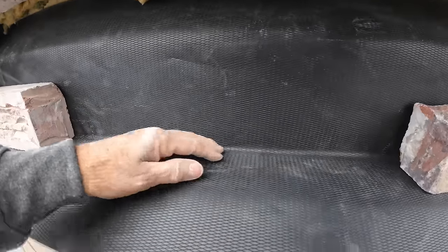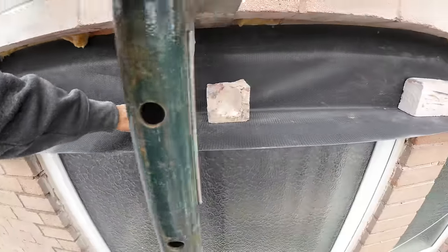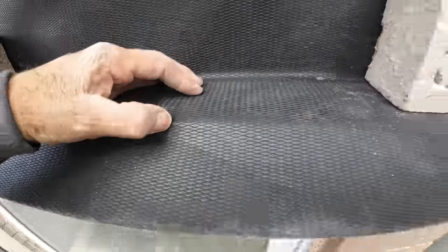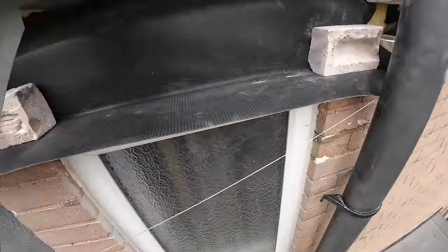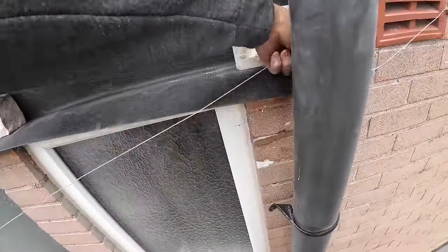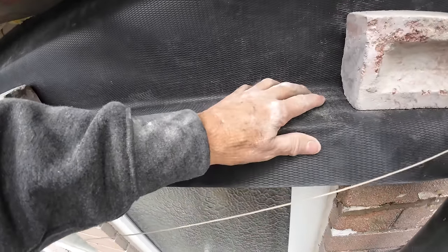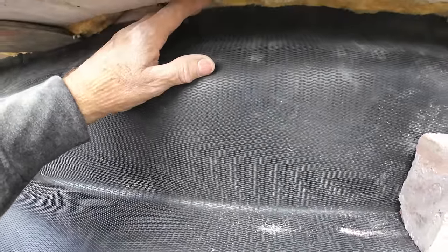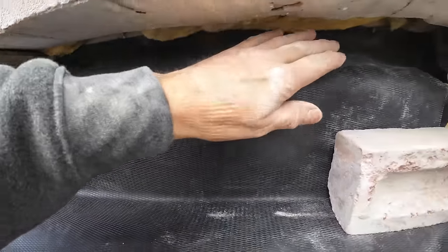This is tucked right in with the bricks. So what I do is I cut it back a couple of mil from the front, just so it's a nice tidy edge. Once I get cracking, my line's up ready to go. Just needs to go at the other end. There you go, that just needs cutting off, and we can get flying. And then we'll get probably a 70mm piece of insulation cut in there and fill that gap up.